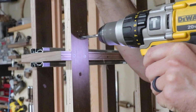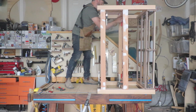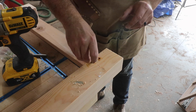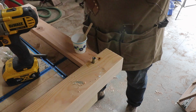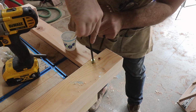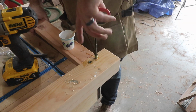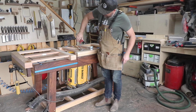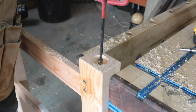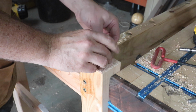Now for the drawer box frame, I added holes to the top just to allow for expansion in the island top. I also decided this was a good opportunity to test out the strength of my workbench. I mixed up a small amount of Total Boat High Performance just so I'd have something a little bit more to help out with the threaded inserts. And I also drilled out a hole in each of the legs so I could add threaded inserts and leveling feet recessed into the legs.